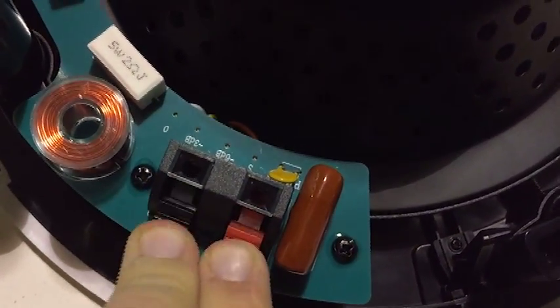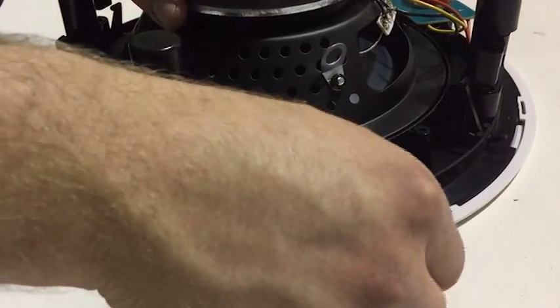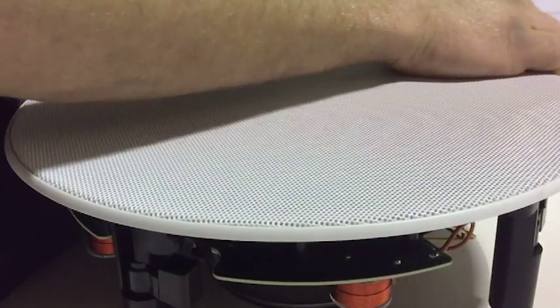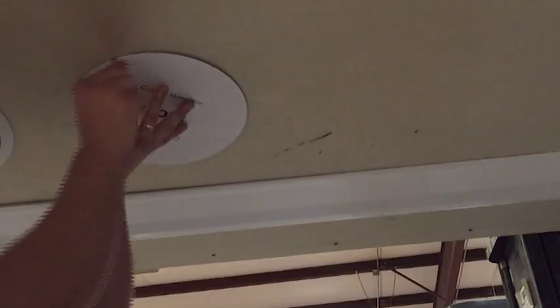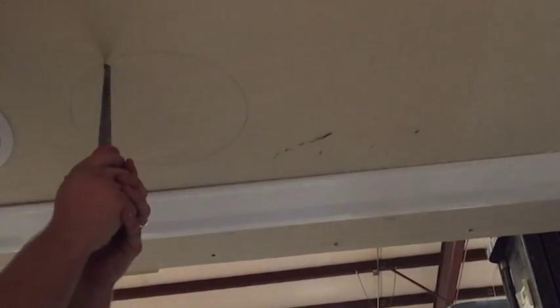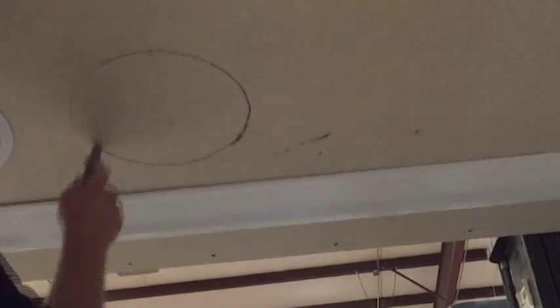These clips make for an easy installation. The speaker grill twist locks into position so you can easily open it without tools — remove it for now until it's installed. Use the cutout template included and mark where you need the speaker. Use a keyhole saw or rotozip to remove the cutout. It's suggested that you cut directly outside the circle; be careful not to deviate from the marks.